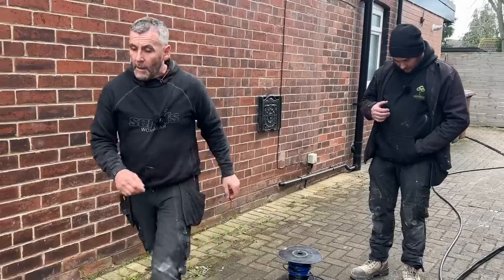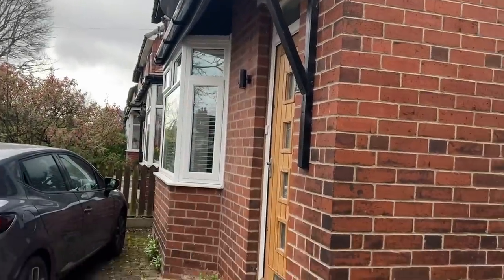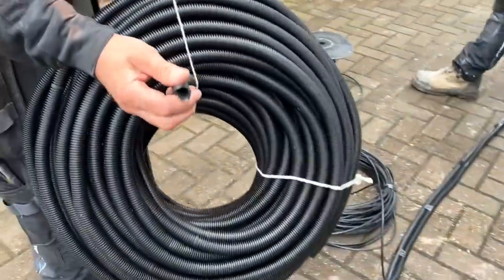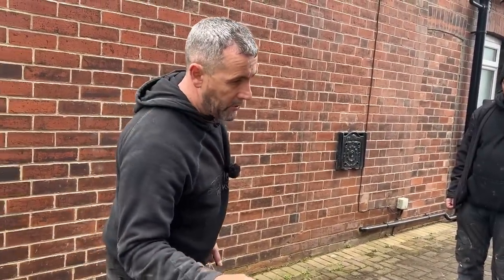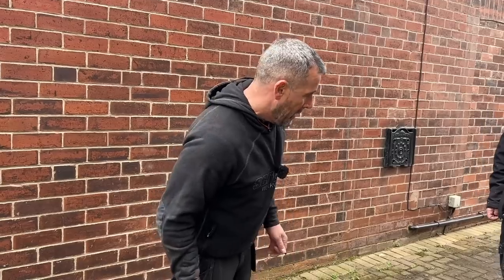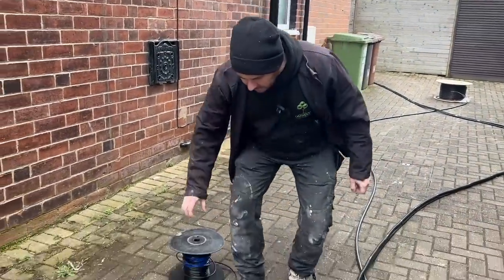We're going to pull the cable now. His internet comes in the middle of the two detached houses so we've got to get the cable around there. We're running 10mm steel wire armoured cable and we've put the CAT6 in some copex - basically 20mm trunking - taped alongside it. Some places it'll just be laid on top of the ground. For steel wire armoured there's no specified depth in the regs, just adequate precaution. John will explain why we run it alongside and why there's no interference.